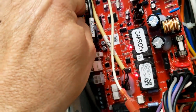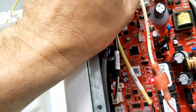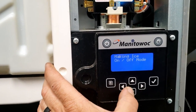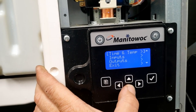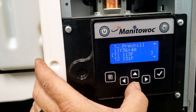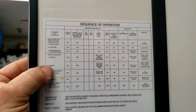Making sure all the plugs are in — I've already checked my thermistor sensors, harness is hooked up. We can go in there and look at our readings: discharge gas 130, liquid I believe 114, which seems a little high. This will tell you where things are at and what's going on.